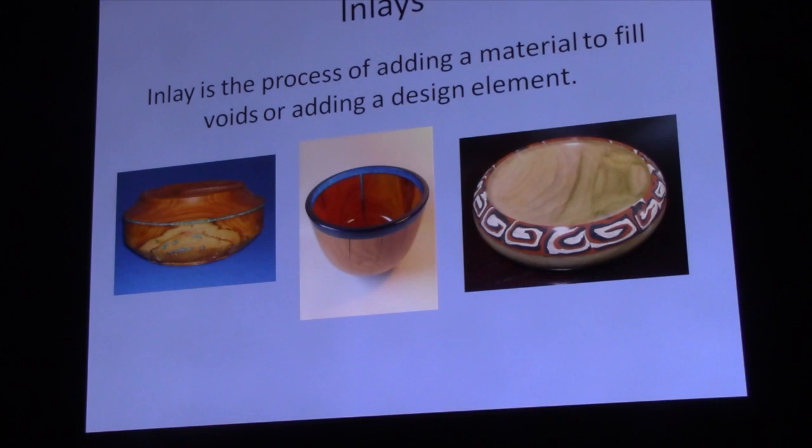But you have to go for 5 minutes, because I made an example at my shop, and I used white. And the thing about white Milliput is the color and the activator are both white. Well, I mixed it what I thought was 5 minutes. Long story short, I put it together on something that's being passed around. The next day I went back to take it off and cut it, and the white was still soft. I had not mixed it long enough for the activator and the color to mix together. So you have to mix that product for 5 minutes.